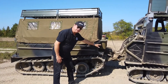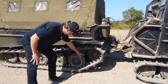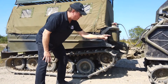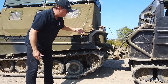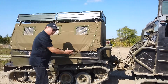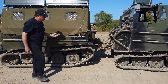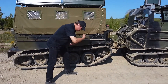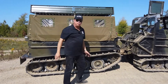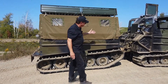The articulation is not just for steering — it also transfers power to the drive wheel here. There's a sprocket here, and in fact there are two on the right and two more on the left, so this is a four-track drive. Very interesting — this rear section, what looks like a trailer, is actually part of the propulsion; it actually pulls the vehicle along. In water, these fins here move the water along, and all four of them are working to propel the vehicle through water.